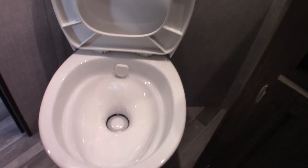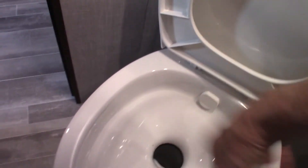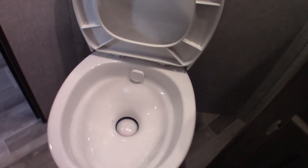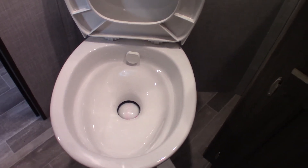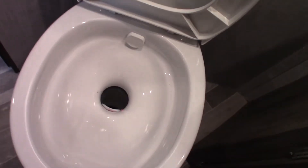The bathroom — I'll go through the toilet. This is the flush pedal. You can't use this dry. The black tank is directly below, and this goes for all RV toilets. After you hook up your power and water when you get to the campsite, you'll come in here with your chemical, step on the pedal, and let about a gallon or so of water go into the black tank. Then dump a dose of chemical in there. If you don't start off with water and chemical in there, the smell will be overwhelming and it can get clogged up. If you had to dump your black tank mid-stay, repeat the procedure — put a gallon of water in there and chemical.